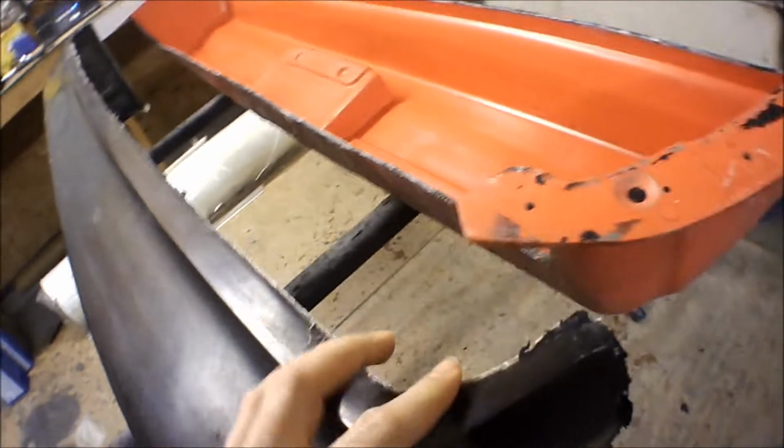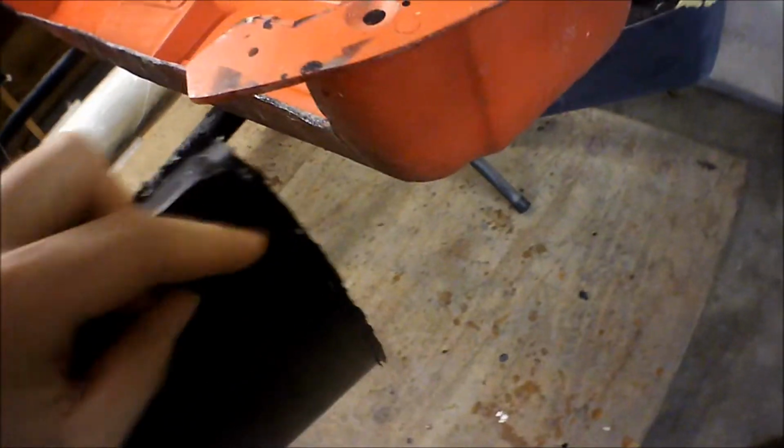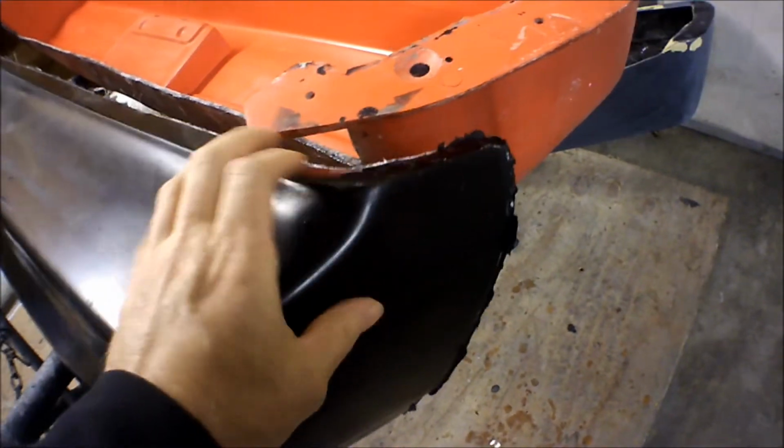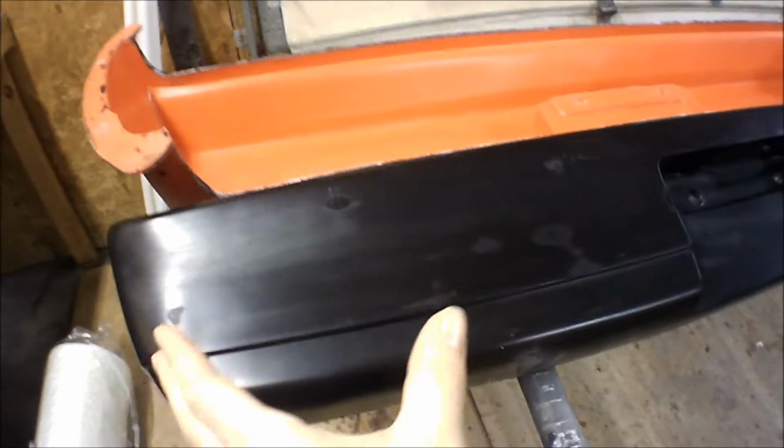But other than that, it's coming out of mold, so your body shop guy's got to go and trim this down and sand the whole thing and primer it and make sure it fits good on the edges here, on the sides, because I know this is not going to fit 100%. It is what it is. It might be in, it might be out. You just want to tell them to fit it as good as they can, somewhere in the middle. And if it's low on one side, just sand this down,